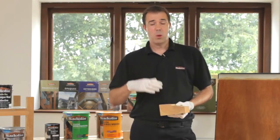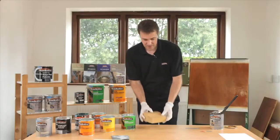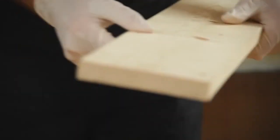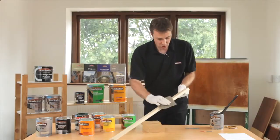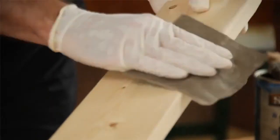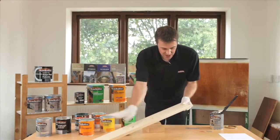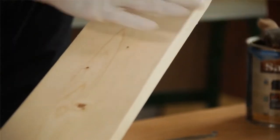The basic rule is that two full coats of a system will last five times longer than a single coat, so sharp edges will quickly become a problem. On this piece of timber with a sharp edge — representative of a windowsill — we can simply rub down the corner, take off that edge, and make sure it's dusted off. The roundness of that edge will then give the coating the opportunity to be applied evenly, and it will last longer than if the edge were left sharp.